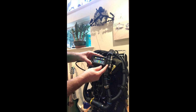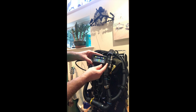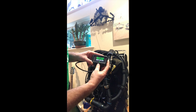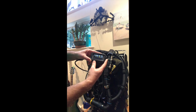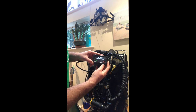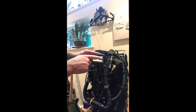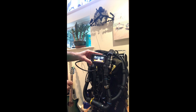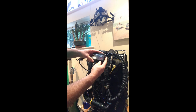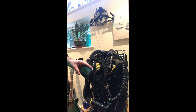You can hear the solenoid clicking. Little self-test on the drain on the battery. It gives you all these steps. I change the elapsed time to zero because I've recharged the battery. For now we won't calibrate sensors, but I'd always calibrate before a dive — and that's telling me 21% oxygen, which is correct, but it should be at 0.7, so I'll turn that off to avoid the beeping.